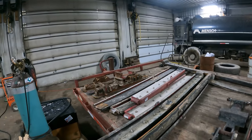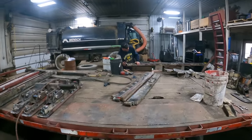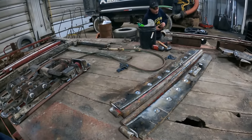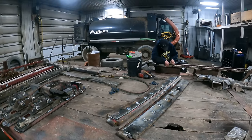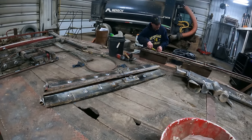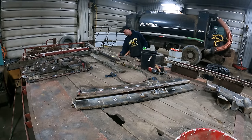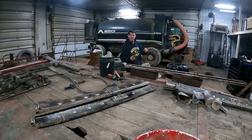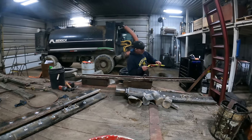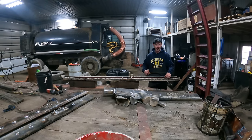We're bedding with sand, which is really abrasive on everything, and we've found the rubber just lasts longer. What this is is conveyor belting — believe it or not, it's an inch to an inch-and-an-eighth thick depending on when we ordered it. They're actually out of it right now and are going to drop off some that is an inch and an eighth thick. We've still got about three inches left even at the other end.